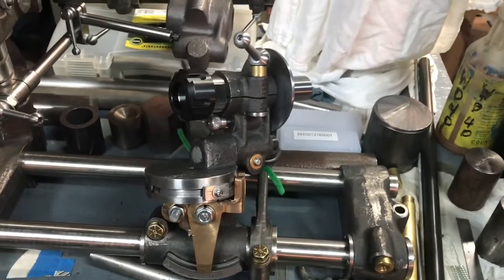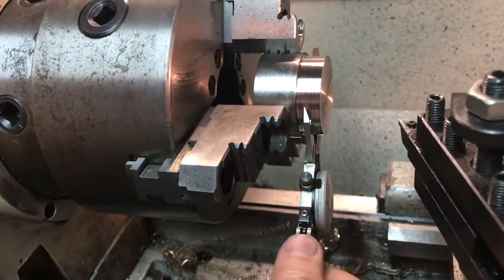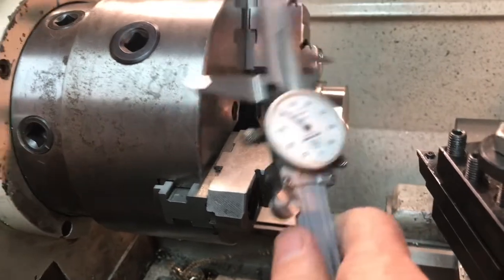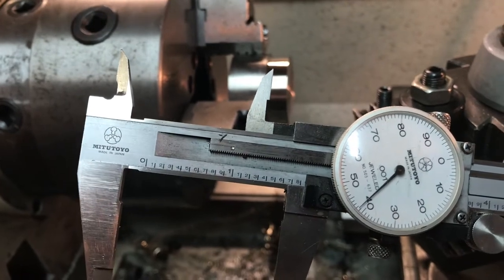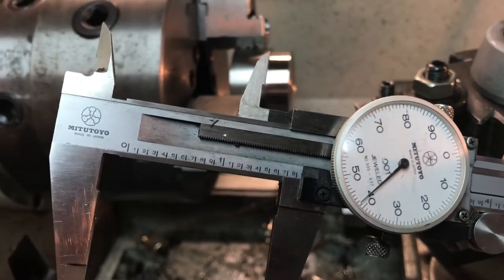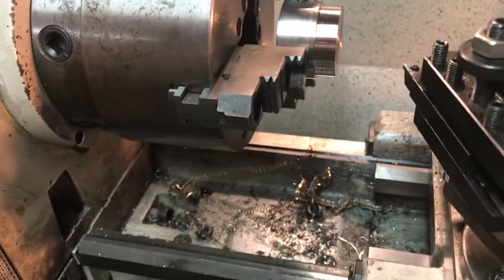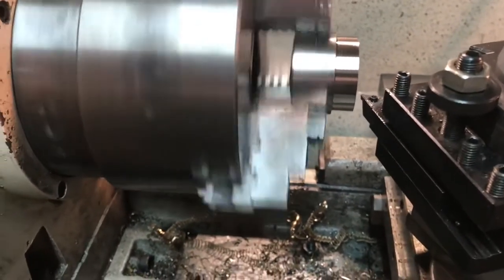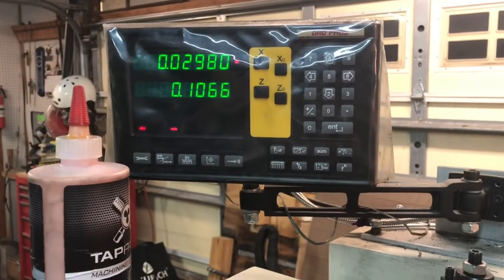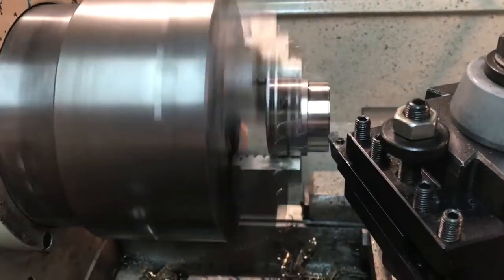Since people like it, I'll throw in some actual machining segments. Using the calipers here, I'm going down to 1.750 inches — I have just under 90 thousandths left to go. I'm running at about 220 RPM with a carbide bit, feeding by hand and taking off about 30 thousandths, so it's a 15-thou depth of cut. I might take more but this is comfortable.